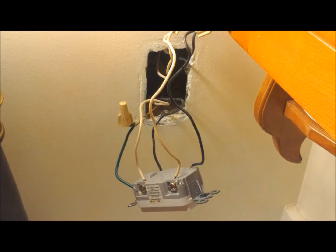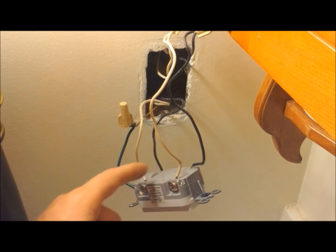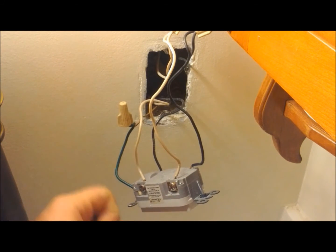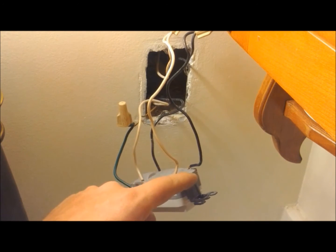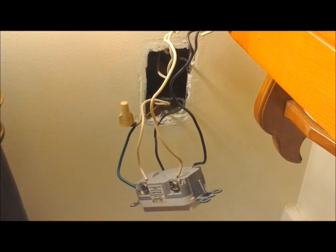As you can see, this one has five wires going to it. We have the black and white here on the bottom under line terminals — that is our power coming in. Close to the ground, we have our ground wire. We also have a black and white up here under load, and what that means is if this were to trip, whatever power is being supplied out of it and supplying another outlet would also be tripped. We happen to know that this bathroom is an exterior wall and it has an outlet out there for the porch, so that is what it's protecting. So this outlet is wired correctly.